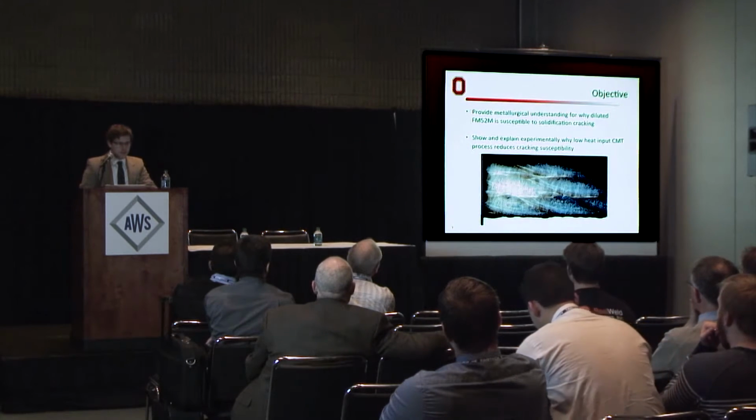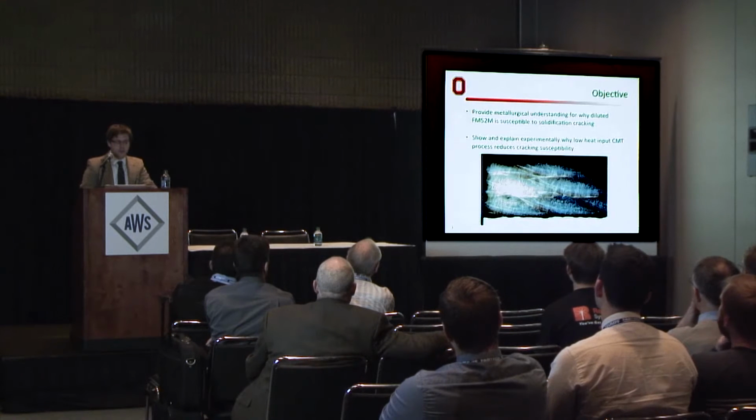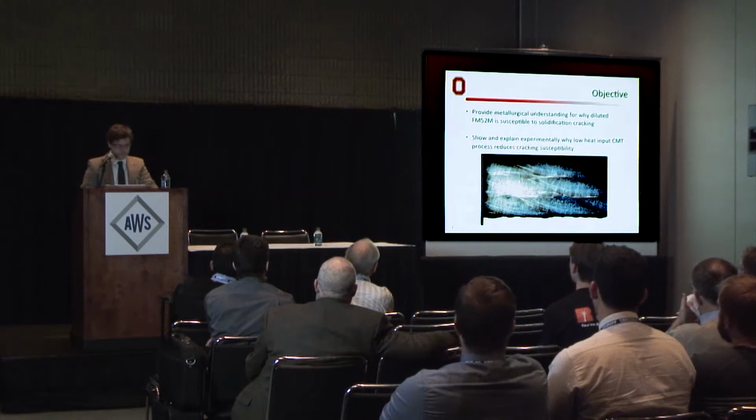The objective of this project and presentation is to provide metallurgical understanding for why diluted 52M is susceptible to solidification cracking, or rather why it's really not supposed to be diluted with 304L, and to show and explain experimentally why a lower heat input process can reduce its cracking susceptibility.